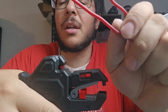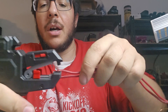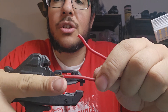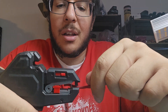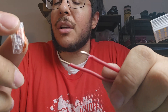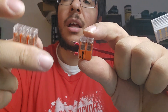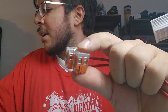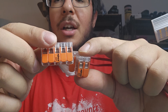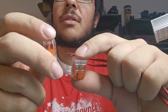Now all I do is grab my German strippers — I'm going to trim my wire, then I can set my stripper depth to what I want, and now I don't have to strip as much, so long term I'm saving wire. Even though the wire is a bit wrinkly it's okay. Then I go to my toolkit — I've got twos, threes, and sixes, or fives — they come in all different wire sizes. You can shove as many wires as you want, and we've got different sizes for different gauges of wire too.